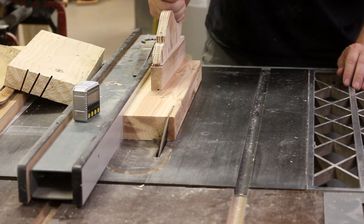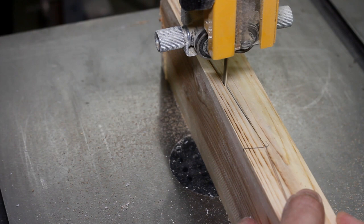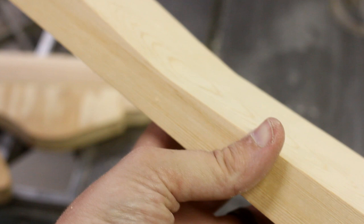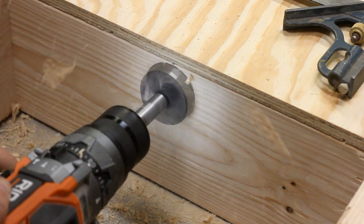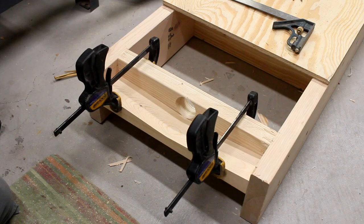I tilted the blade by about four degrees and cut an edge on the board I'll use in the trough that collects all the missed shots. Then, with the flat edge down, I drew a V pattern across the canted edge and cut that out over at the bandsaw. These will make the angles that filter the missed shots to the center. A little bit of sanding takes off the bandsaw marks and then I cut the other canted edge on the table saw. This gives you kind of a parallelogram profile. Then I drilled in a two inch hole right in the center, as close to the top of the brace as I could.